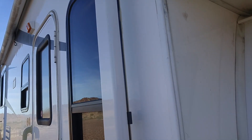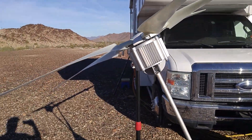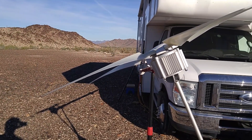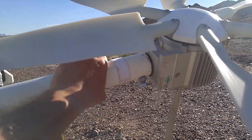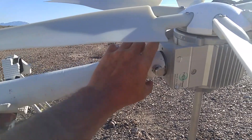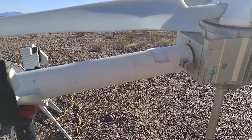So far I've had no problems with the mast or the turbine. However, when it's not plugged into a battery, the automatic brake will come on — it'll spin up real fast and then stop, which torques the mast a little. I've put a metallic post insert inside so the torque is felt by the metal going all the way down, not the fiberglass.